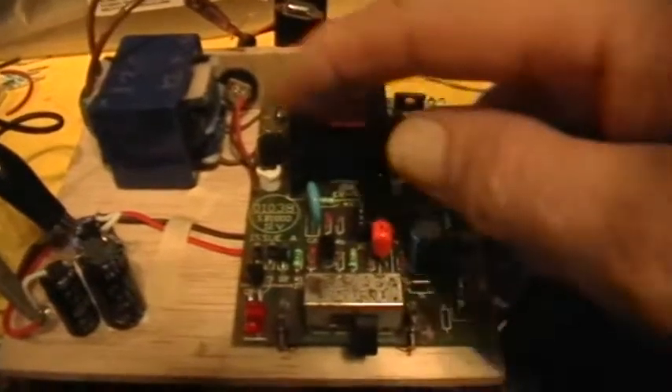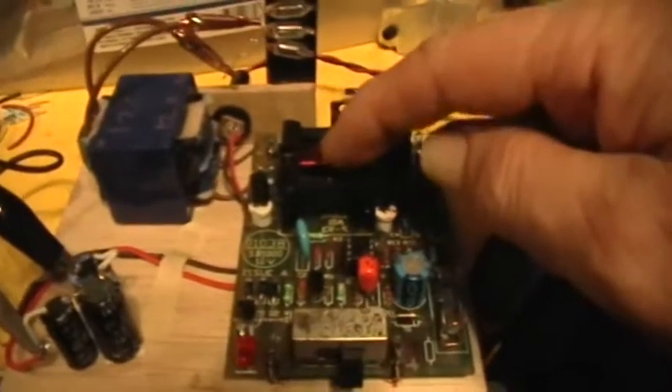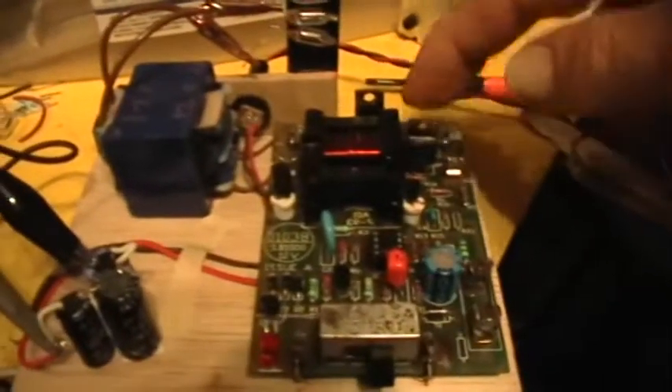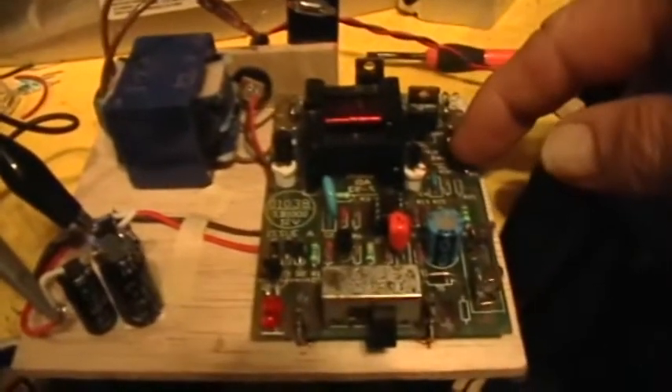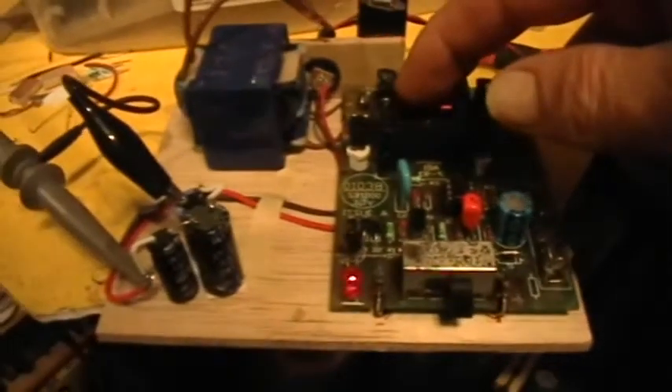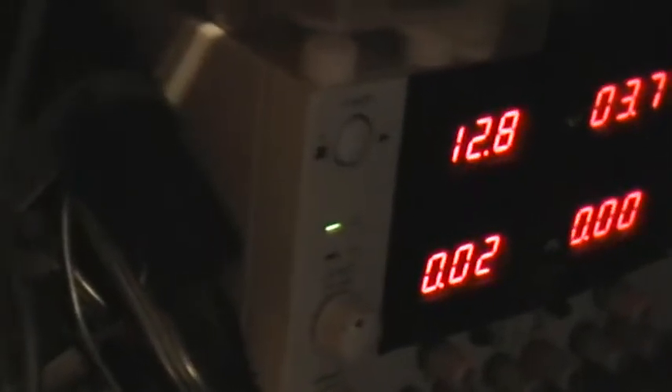It's got to charge by oscillating and ringing the inductor, and then the inductive back spikes are stored on the capacitor to be dumped later by the SCR into the transformer. The spikes are not being made as high voltage as they should be, and the current input is way below what it should be — only about 20 milliamps when it should be 80 to 100 milliamps. That's the progress report on the troubleshooting of the SpeedRite fence charger. Thank you for watching.